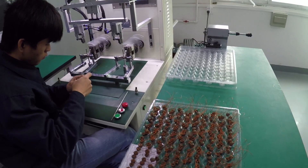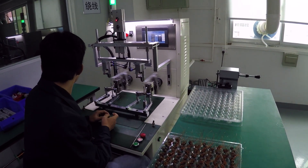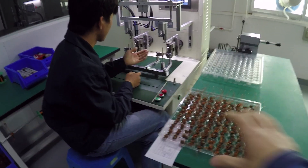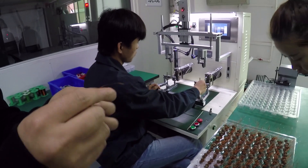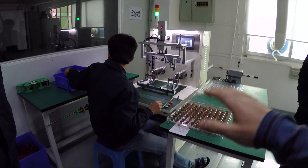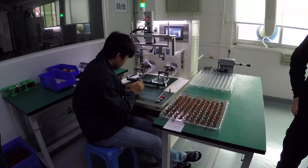The first place we went was the stator winding area. You've got the raw stator, and the windings come through a spool. This machine spins and also turns the stator, winding each individual stator individually and turning it around, ending with the finished product. It was possibly a run of the R3 blue Returner 2206 2300KV. The machine is programmed — you put in the specs and it knows what stator you're using, what winding pattern, and how many winds. You're telling it the wind count, and the resulting KV follows from that, because it's the number of winds on the stator that determines the KV.